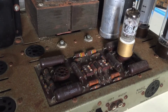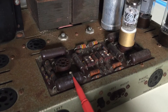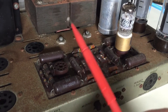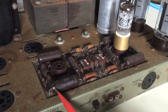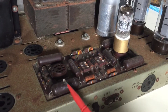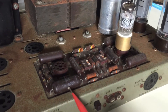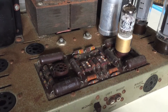The next thing we're going to discuss are the capacitors and components on the board. The ones we're going to talk about first are the decoupling capacitors right here that go to the EL34s — they're on the ends of the board. After the signal comes out and is phase inverted, we end up with two signals. Those phase inverted signals go to these capacitors where the DC component is removed, and they make their way to the EL34s. If these capacitors are leaking DC, then they are no good because they are no longer decoupling the DC from the resulting audio output.